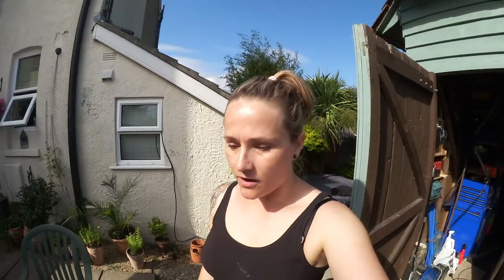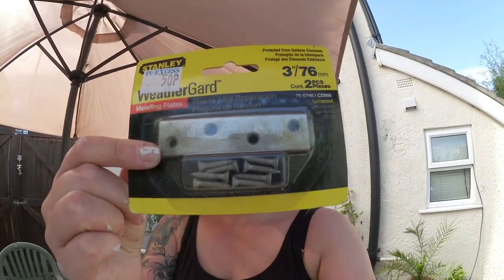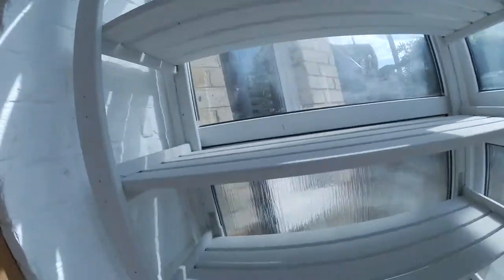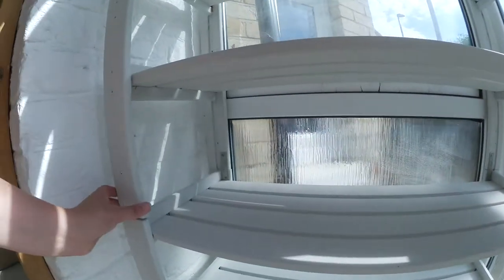I've finished painting them — not too bad. I was expecting to need more coats than I did. Now I'm going to secure them with these little bracket things called mending plates — only about 50p for two. This is what the shelving unit looks like now; they've been hinged at the back to hold them in place so they don't come apart. If I needed to move it around a lot I'd add more hinges, but it's going to stay here now.